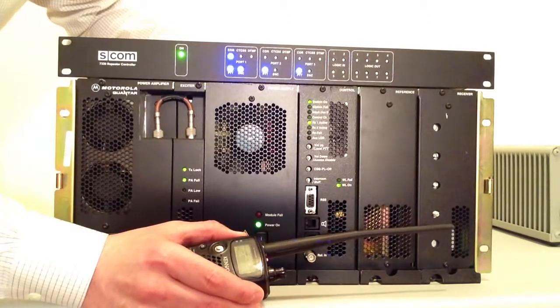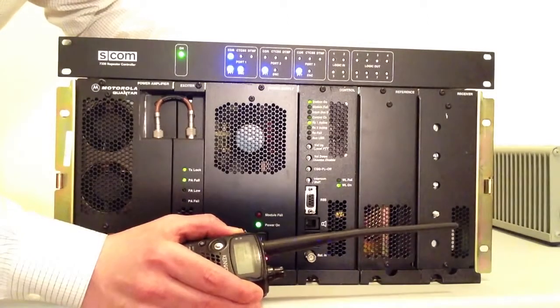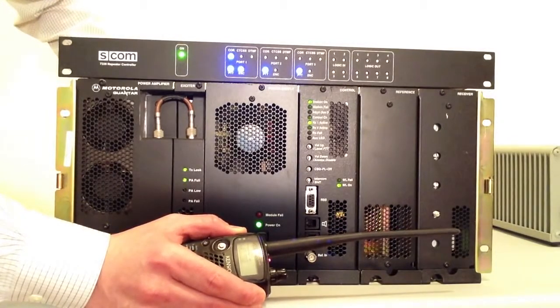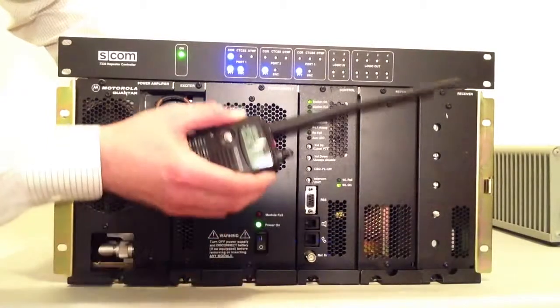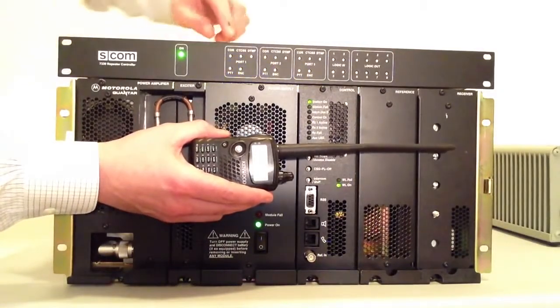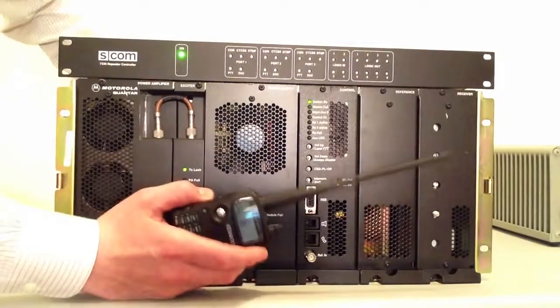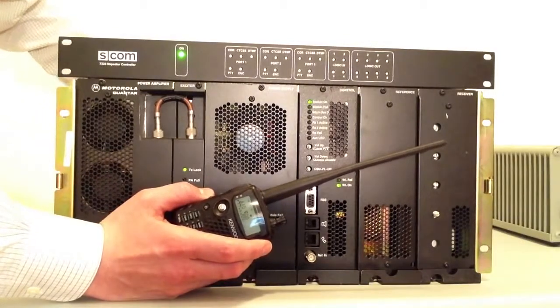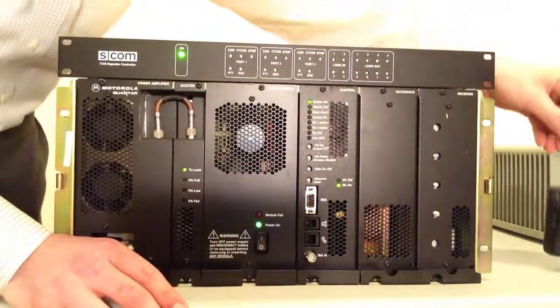Now I'm going to do that one more time because what you're going to hear is what sounds like a Nextel beep. It happens to be this controller's courtesy tone, and it's going to release encode by sending a logic low to the back of the MRTI connector. But look at the timing of when this happens. We heard that courtesy tone well after the encode light went away, which means over an IRLP node you would have heard nothing. So that concludes the demonstration for the basic cable.